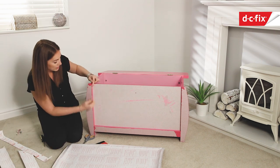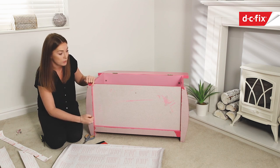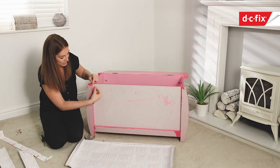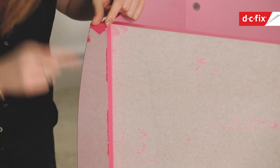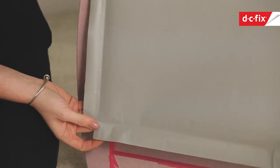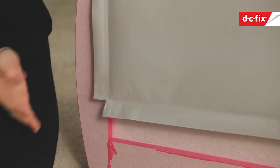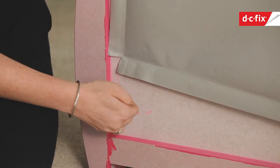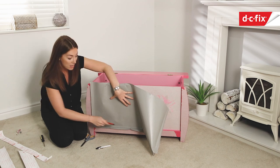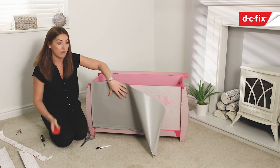With the grey section, you'll notice there's kind of an alcove - maybe a centimetre or so - which means there's an internal corner that I need to push the plastic into. I've allowed an overhang by measuring the section, adding a centimetre for the alcove, plus a bit extra to trim away. I've also cut a little square out of the corner of this section, which allows me to push it in and get it right into the groove. You can use the smoother with its felt covered side to create a fold in the paper so you can see exactly where it fits.